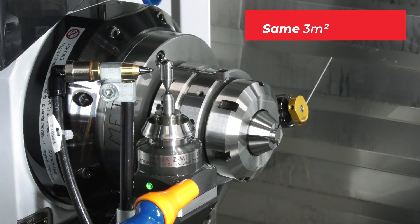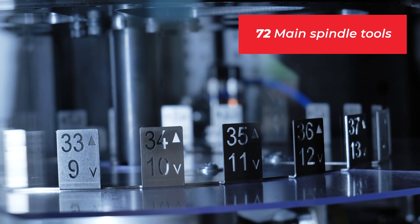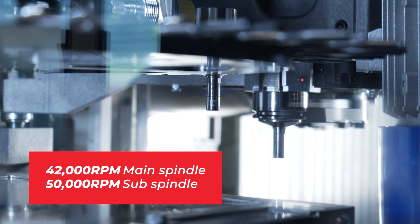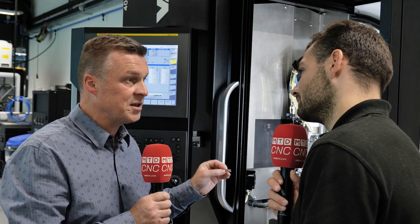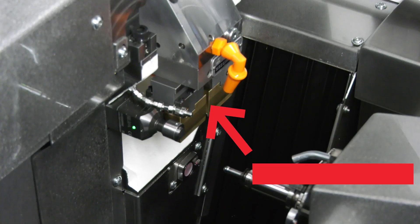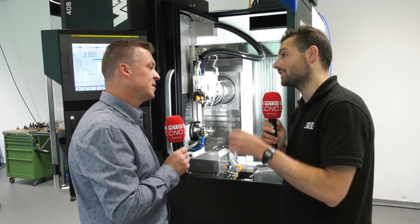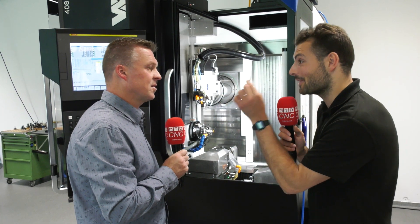So you can do really, really fine micro machining operations. The second side machining is made for three-axis machining with this very accurate, very high frequency 50,000 RPM spindle, and the part is clamped in the vise. The 50,000 RPM helps you with fast light cuts, even in titaniums, hardened steels, and difficult-to-cut materials — you can deal with them. Let's talk about this part here now.